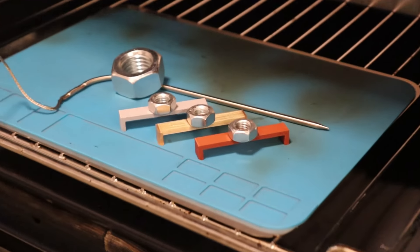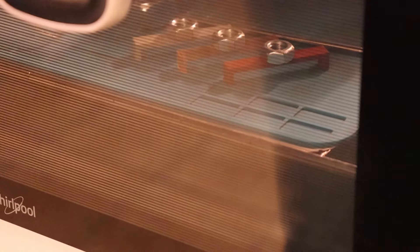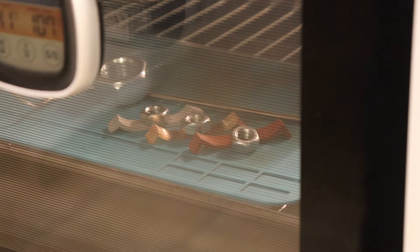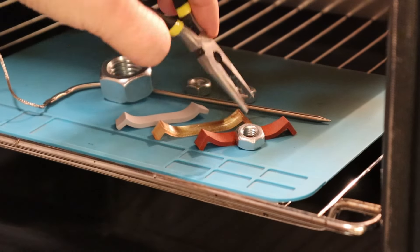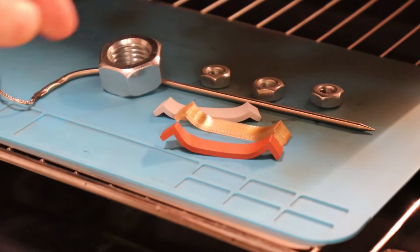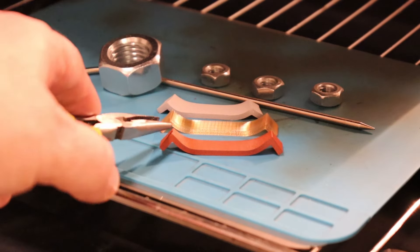Now the temperature test in the oven. This experiment is important with these materials because one of the reasons you want to use PETG instead of PLA is exactly this bigger temperature resistance. This is a speedup timelapse video. As I expected, the basic and translucent have very similar deformation temperatures, and the carbon fiber version is always higher — over 100 degrees Celsius, so I will stop the experiment. After half a minute I can even touch them with my hand. The feeling is equally soft on all three, but biggest deformation on the basic and the smallest on the carbon fiber version.